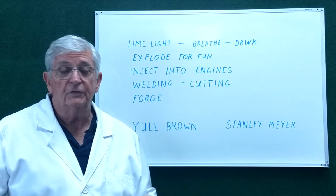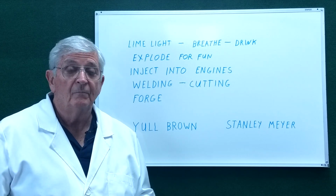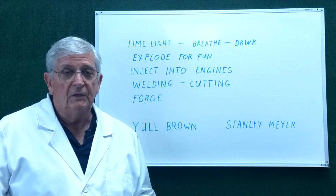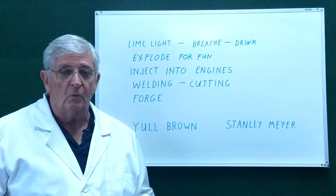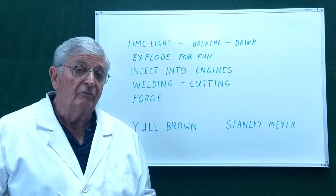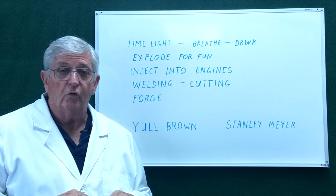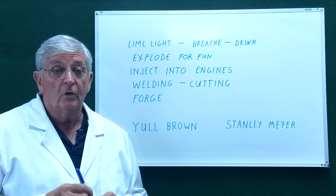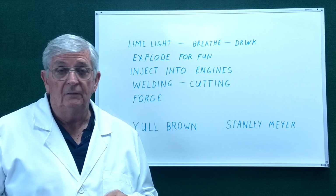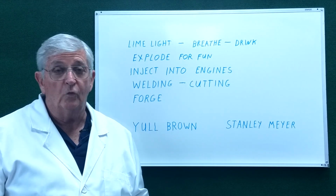You'll see a lot of videos on forges, metal melting forges, and they usually use propane, and you'll see blowers forcing huge quantities of combustion air into them. And for every cubic foot of oxygen used for combustion, there's 4 cubic feet of nitrogen that come along for the ride. And that's a lot of mass to be heating and then just blowing through your forge.